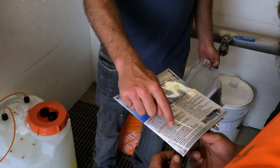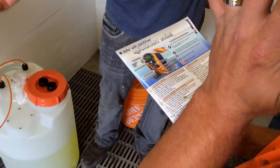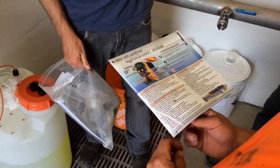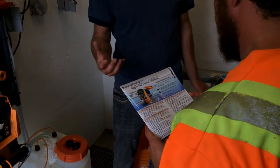You're going between these two. The analog signal you shouldn't ever have to play with, because it should be set, and then you're gonna speed up and slow down the pump really from over there. Manual mode is just, if I wanted to change the speed and run it manually for a little while, that's what you would do. Contact, don't worry about. It's basically analog.